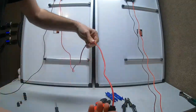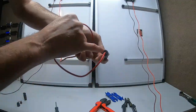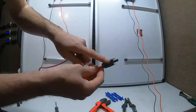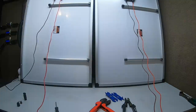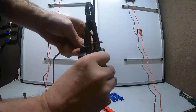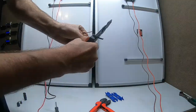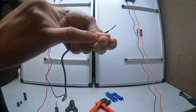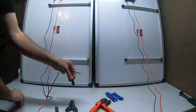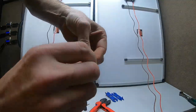The positives are done. These wires are a little small for these clamps, but because you fold the wire over and put them in tight enough, they still water-seal and hold the power. Now we do the negative — the last one. Strip about an inch, or a little more if you want. Spin the stripper so it cuts the wire all the way around in a circle. Strip it clean. Try not to lose any wire strands in there.